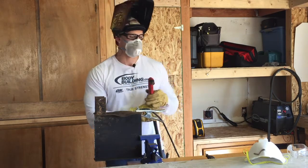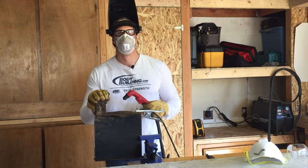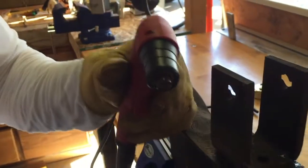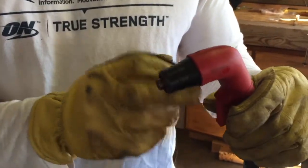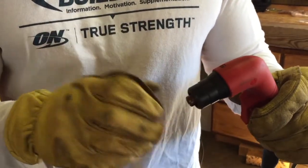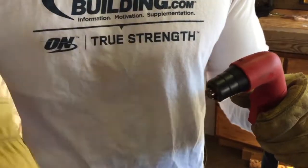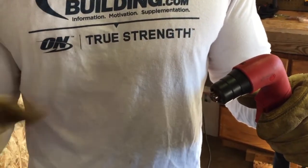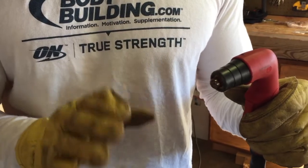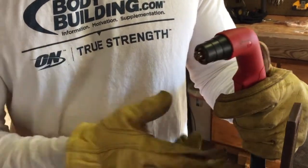We'll give it a go. I'm fired up and got my air line hooked in. I'm going to be making a cut on this 2-inch piece of steel, 5/16ths thick, and I'm just going to start here and work my way across. What I'm going to do first is test-fire the handle to make sure I'm getting air coming out. One of the fastest ways to blow through an air diffuser is to not have your air hooked up and try to make an arc - those are probably one of the more expensive pieces to buy. Make sure you've got air coming out, as this thing continuously pushes air to cool it. I'm looking for a good, clean arc. If I don't have a clean arc on first try, I stop, check everything, and clean it up.